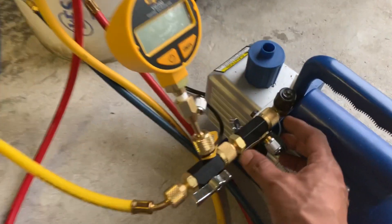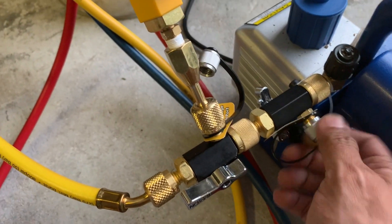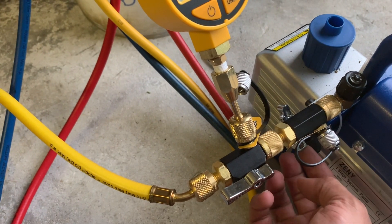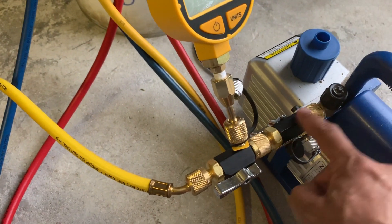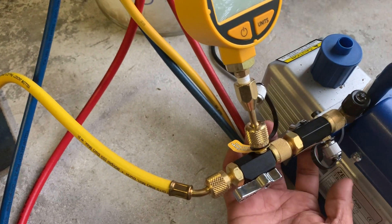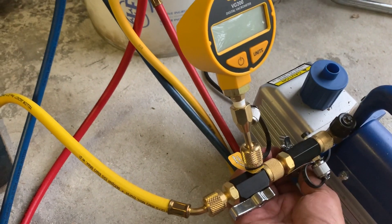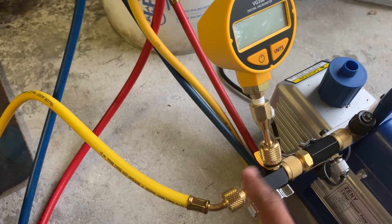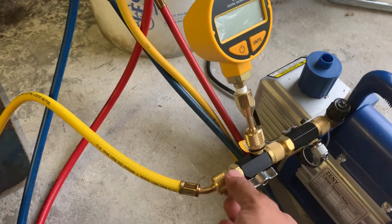So this is my setup — I'm using these two valves connected right here. This side is sealed, I connected one valve over here, and this side I'm going to seal as well. I have my valve closed on this side and I can go ahead and open it. It comes into another valve which is also open, so I can control this valve — once I pull the vacuum I can close it to isolate it from the pump. I have my CPS vacuum gauge connected here.